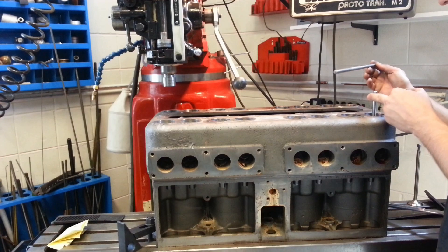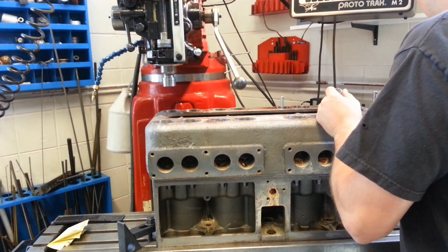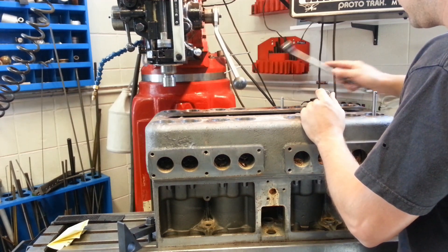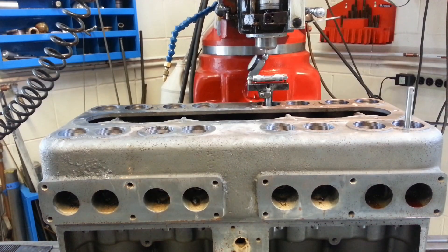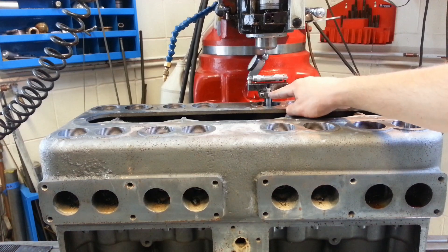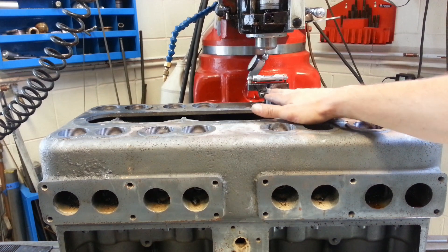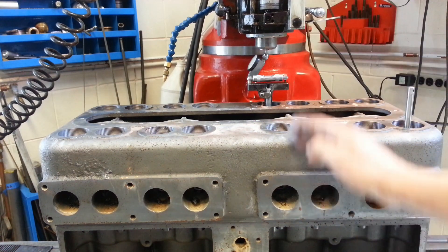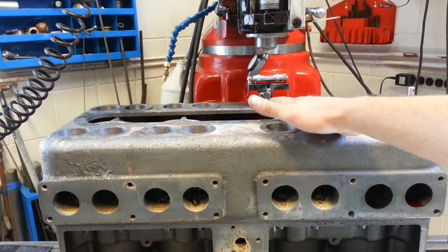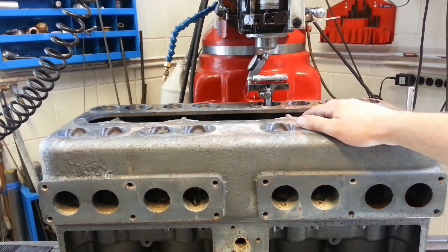Okay, here's my pilot. I have another pilot here that's a couple of tenths different and we're going to cut this seat here — drop the pilot in, get a little whack and spring. Here I have my vial and I will level the pilot to the J head. The J head is perfectly leveled to the table and now I'm going to level this so that it's all on a straight axis so my concentricity can be within a thousandth.